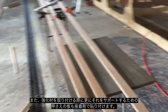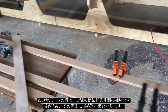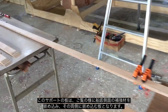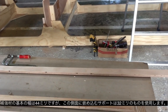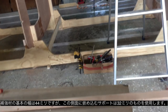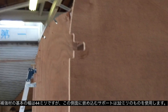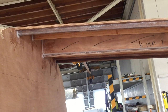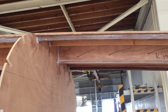I've also been gluing up the flange pieces. These will go onto a stringer that's been cut down — the normal stringers are 44mm wide, but this stringer will be 32mm. It will sit where the side panel and the radius chine will join. There's a flange on that stringer which will be where the joining of the bottom skin and the radius chine meet.